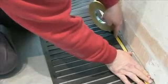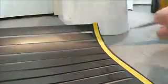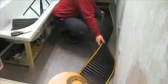The element's very robust stuff, and you can even staple straight through the polymer sheets onto the floor as long as you don't staple through the copper braid that runs along the edges of the element. It's important to keep the elements at least 2 centimeters apart and at least 3 centimeters away from anything metal like central heating pipes or radiators.